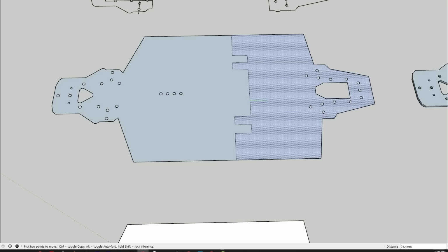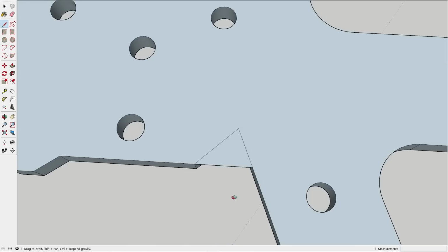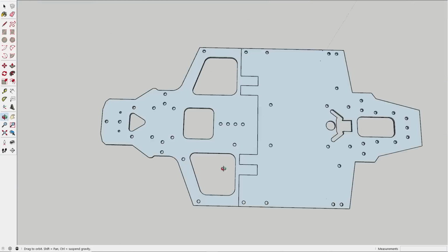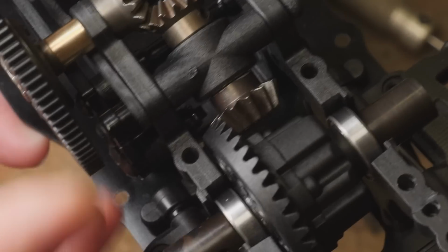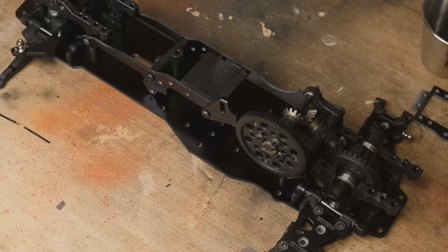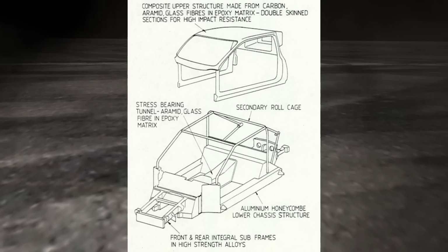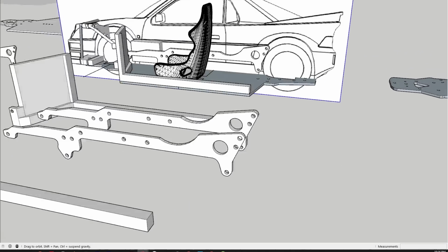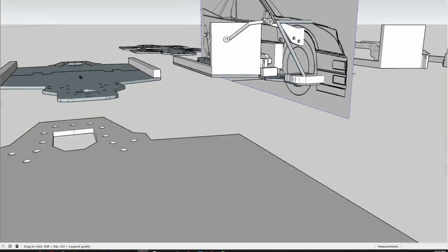The goal is to be able to create my own chassis to fine-tune and adjust the wheelbase of that chassis while including mounting provisions for structural scale components. Being rear wheel drive and having the power plant attached to the rear bulkhead makes this a fairly easy thing to do. Using some architectural style images from the internets, I started to loosely plan where I needed room for scaleness and where I had no way of avoiding massive spur gears.